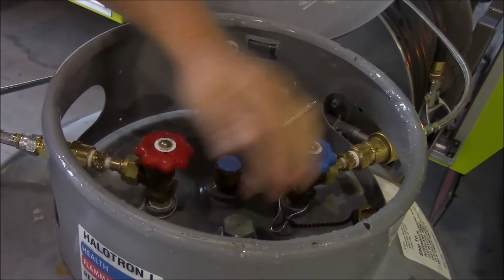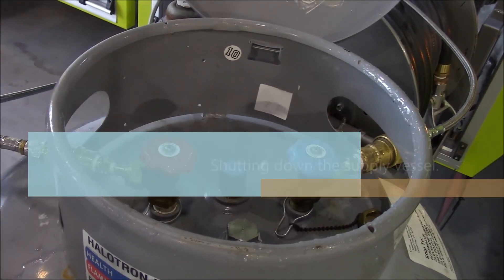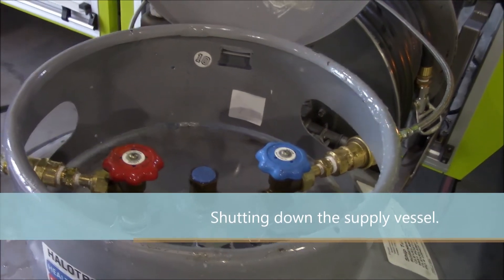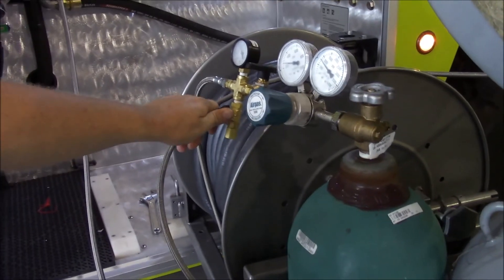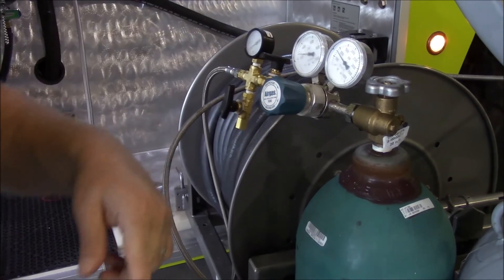You're going to shut off the liquid, then shut off the vapor — get them both shut off so they're disconnected from the truck. We can bleed the pressure off the vapor line over here. It's closed off right here and we can bleed it off — we've got a bleeder valve right there. We just bled off the vapor pressure off the inlet side.